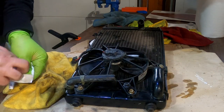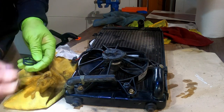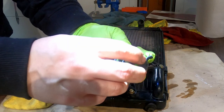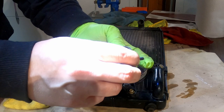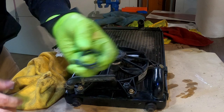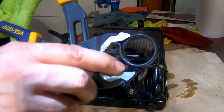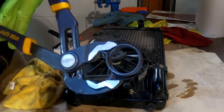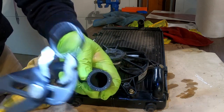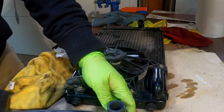One thing you have to be careful of is measuring the diameter of the clips whenever you get a new one. They do stretch out over time, but there are multiple sizes. If you get one that's two millimeters bigger in diameter than it should be, it'll slide off easier than it should — you don't want that. Make sure you can get a good grip on them right here so they're not going to come flying out when you squeeze. I'm going to get my red rubber grease — I coat it in red rubber grease to make the clips easier to slide, and I also put a little on the inside. It keeps it supple and makes it easier to slide on and off.